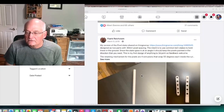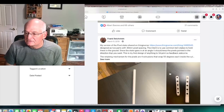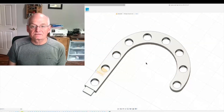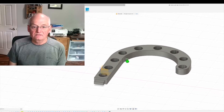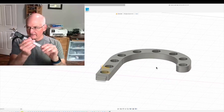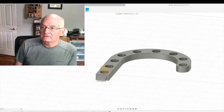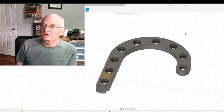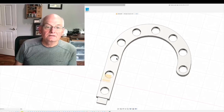So I downloaded it — it's got a link to Thingiverse right here, and when you click on it, it'll take you to download the STL file so you can print it on a 3D printer. Once I printed out Frank's design, I designed the top in Fusion 360 for it. I printed out the actual bottom, took my calipers and measured it, and made my own part. You can see it's got the tongue portion — tongue and groove. The model has these little nubbies inside it, just like Frank's, so I could push the pixels in and they would stay in place.